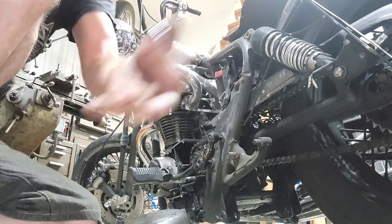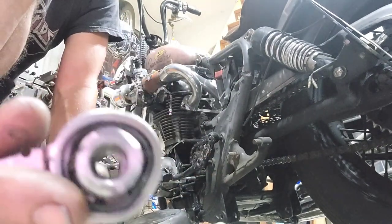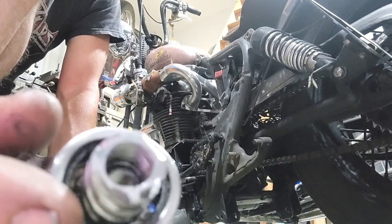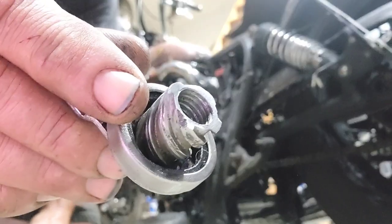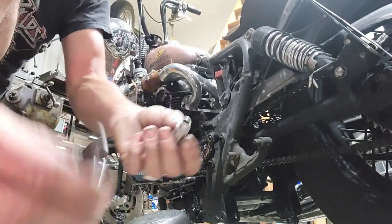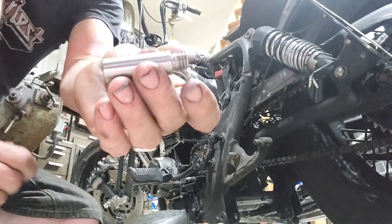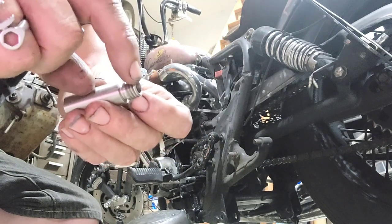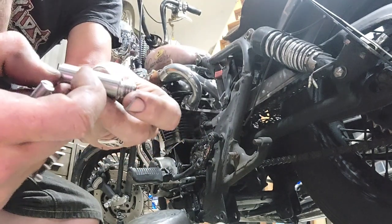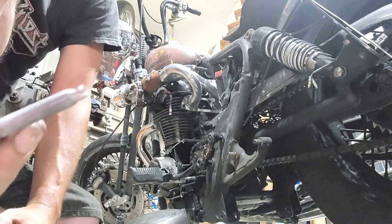I took this piece, and as you can see it is threaded way up in there — fresh thread, there you go, focus in there. So the inside is threaded. This should thread right onto here. The inside of this piece is eight millimeter bored out — just a hollow hole — until the last little bit right here, which is threaded for M8 1.25.